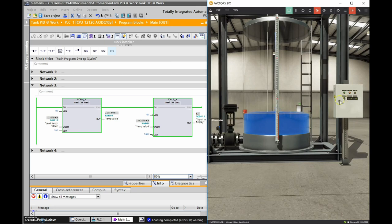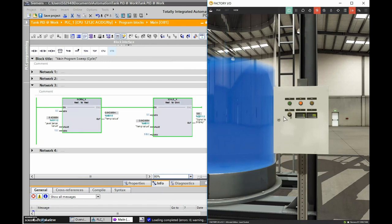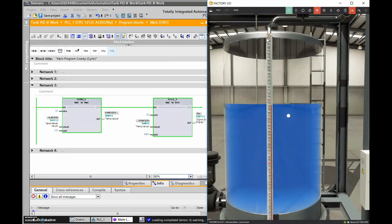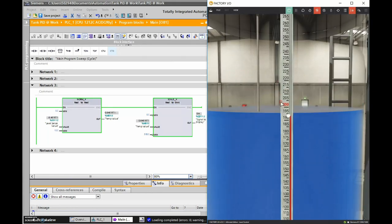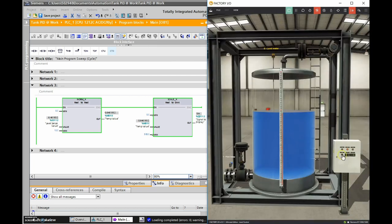Let's increase the level in the tank. I'll show how I'm using a potentiometer to fill the tank in a later video. We should be at 194 now - let's take a look. There it is, heading right there. Zooming in: 194 in the tank, getting 6.46 volts out of 0 to 10, giving 64.6% of the 0 to 300 scale, which equals 194. Beautiful.